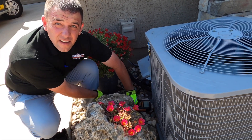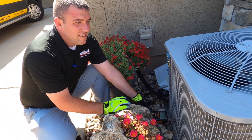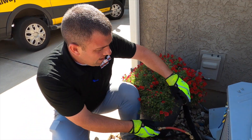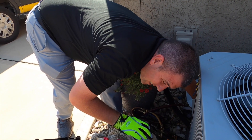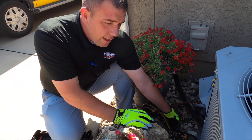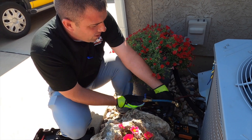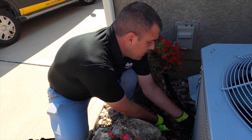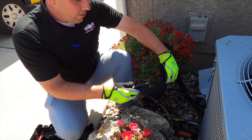These gauges are called Testos — the older version, probably came out five or six years ago. I've been careful with them and they're doing the job. It's nice to have digital gauges because I can use the same gauges on R22 or 410A, which are both refrigerants we work on. It makes things more efficient — I can measure everything without additional tools for line temperatures. It tells you in real time what you're looking at.